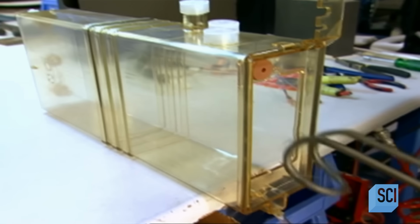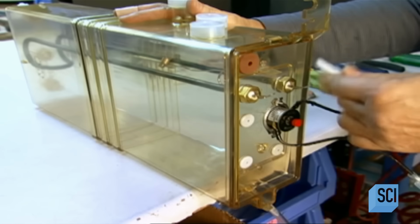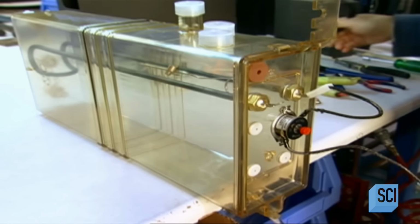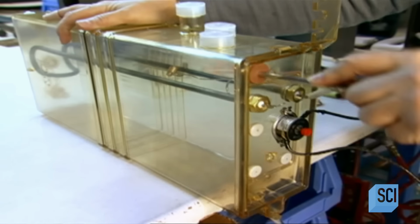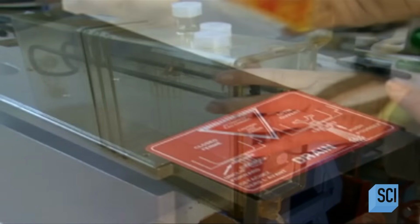Next, they install a heater and temperature sensor inside a plastic water tank that's nearly 2 gallons large. This 1100-watt heater keeps the water at 200 degrees Fahrenheit, just below boiling. That's the optimal temperature for extracting flavor from ground coffee beans.